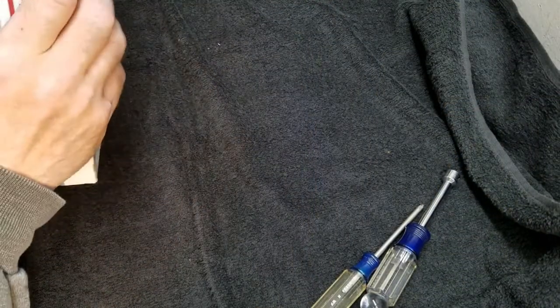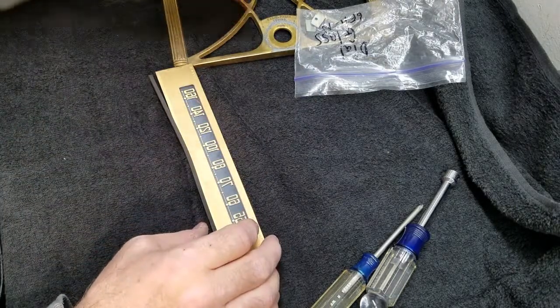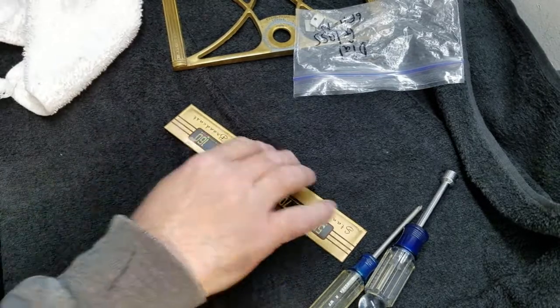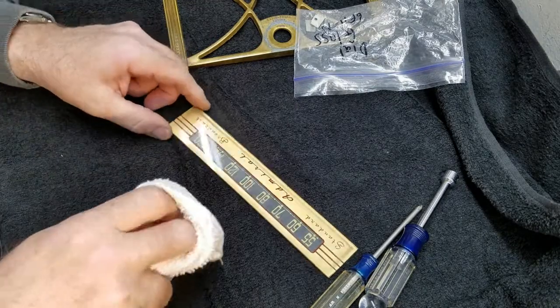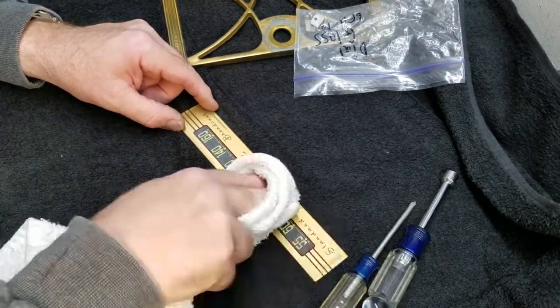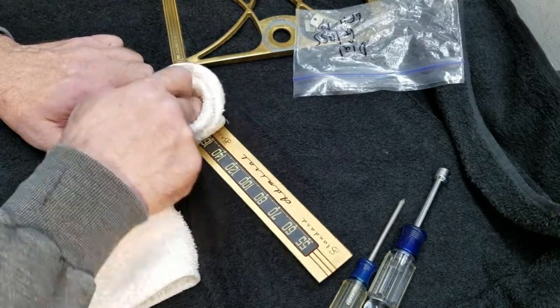What do you say we get ready to put the dial glass back in this trim? So let's go ahead and lay the trim out there. Get the pieces out. Put the dial glass. Now I don't want to put a dirty dial glass back in this thing, so I'm going to do it right and clean this dial glass up. I mentioned earlier that the paint is actually on this side. And it's a multicolor paint, really nice. Admiral always did a nice job, and they always had a similar dial. I've got a full-size TV console that has a dial that looks a lot like this. So this is moistened with just plain water. And you want to make sure you're working on a nice, flat, even surface, because you are pushing down on it just a little bit. You don't want to crack this glass, because that will suck. It's probably available in reproduction, but why would you want to?